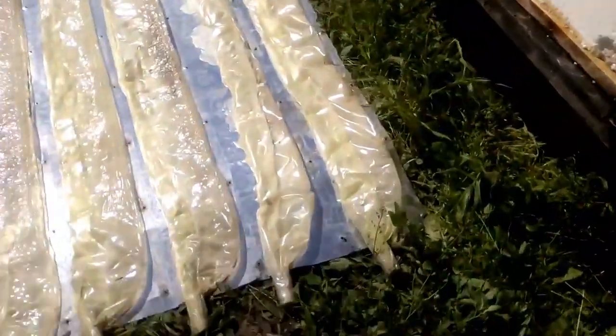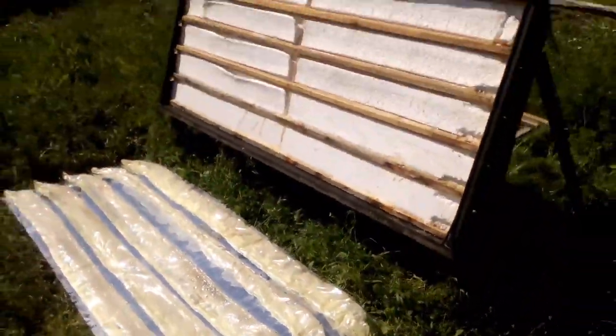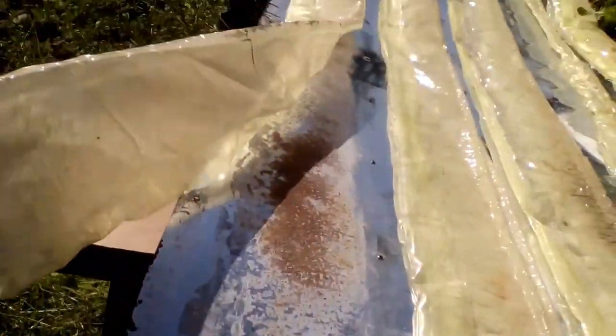We see that the high temperature melted polyethylene of the sleeves, and they stuck to the hot steel sheet, and it is clear that further operation of these two sleeves is impossible. I remind you that these sleeves are made of low density polyethylene with a melting point of about 110 degrees Celsius, but high density polyethylene, polypropylene, mylar, rubber, teflon and many other polymers have a higher melting point. These three sleeves were only partially filled with water when they were several times in stagnation temperatures above 100 degrees Celsius, and they are also stuck to the steel sheet, but only their upper part is stuck because the bottom of these three sleeves was filled with water during those stagnations.